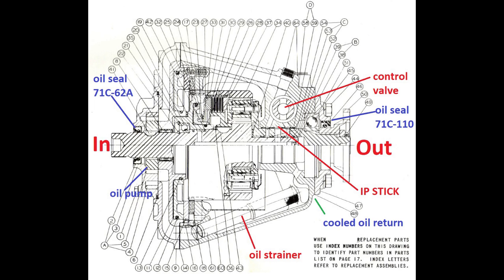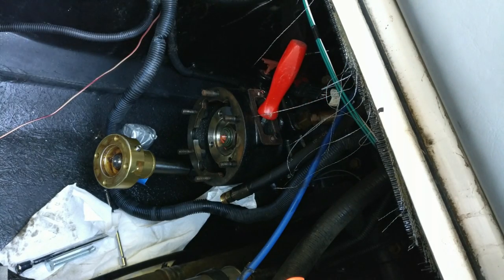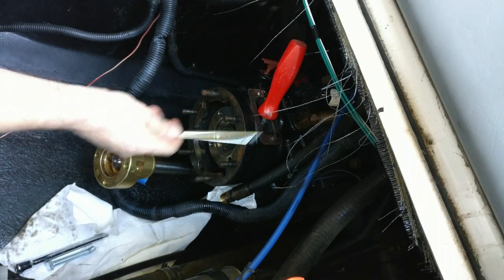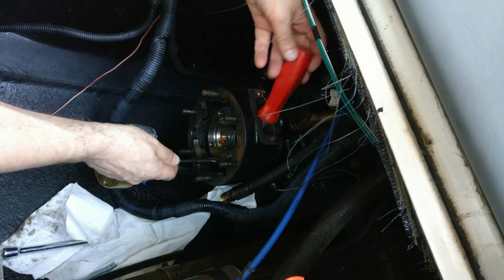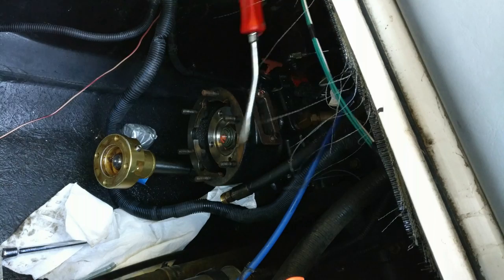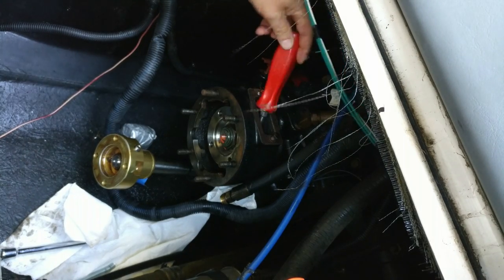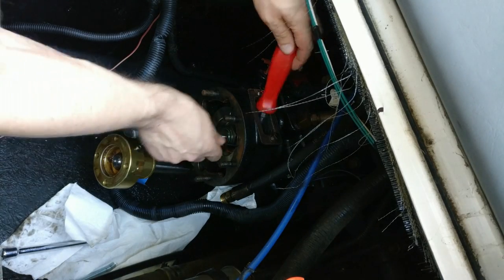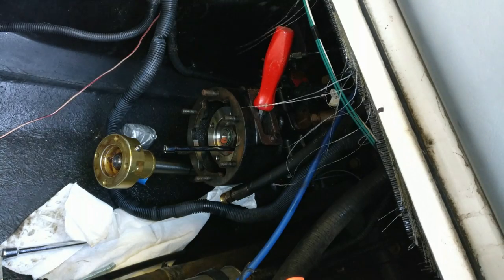Now I'll go over how to replace that output shaft oil seal. Alright, you need to stick a screwdriver in here, and then you need to put something that's hardened. If you use a screw, you'll shear it. So you need something hardened. Look what I did to my screwdriver. And it is hardened. So, you need to put a screwdriver, put something hardened, and then rotate that